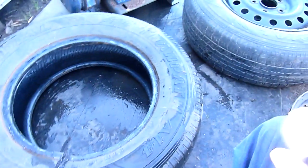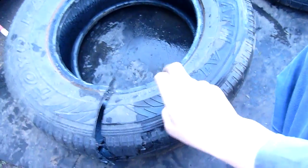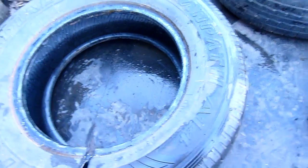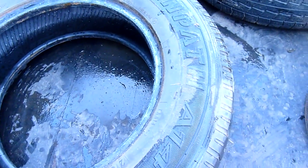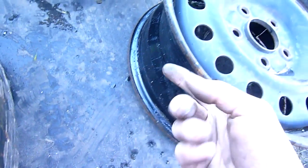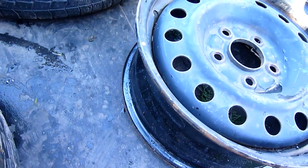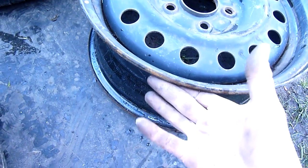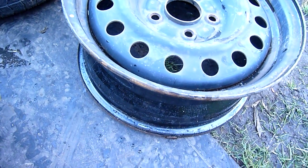G'day folks. I'm just tidying up out here and thought I'd strip down the tire that I popped with the water pump. It's video worthy since I found that the rim itself is partially distorted. These outer lips have been peeled up a little bit. This did fail at 250 psi, so that's a ton of force being pushed against that edge, and they have failed.